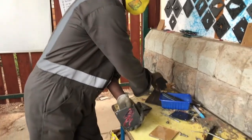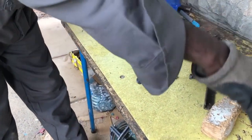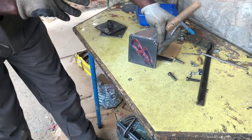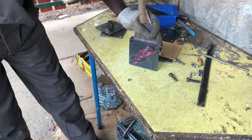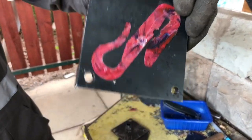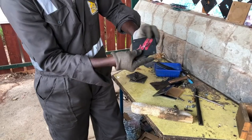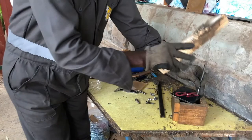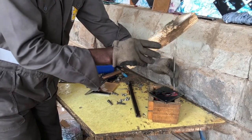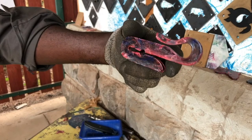The next step: you'll see Farris use a tool — it's kind of like a paint scraper, but he made this one himself — and that's what he uses to disconnect the outer nozzle from the actual mold. You can see there's a bit of a scar left, but not too bad. Then he removes the product from the actual mold, and there we have it.